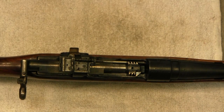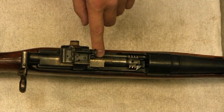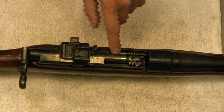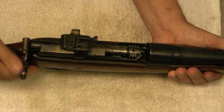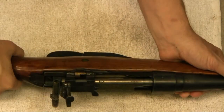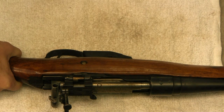Let's start by taking a look at how you can tell if your Ross rifle is safe to fire in its current configuration. When you know what to look for, this is actually exceedingly easy. What we have here is our bolt and our bolt sleeve, and as long as when the bolt is in the rifle you can see about an inch of exposed sleeve, your rifle is safe. When misassembled, you'll have the bolt with the lugs horizontal but with quite a bit less distance, having the bolt head snug up against the sleeve. Something else you can look for is this rivet right here — a modification made after the fact by the Canadians. Putting that rivet in prevents the bolt from being reassembled incorrectly, so if your rifle has this rivet you can be very sure it is a safe rifle.